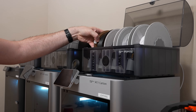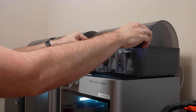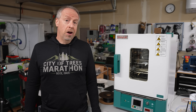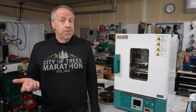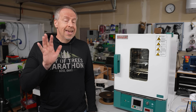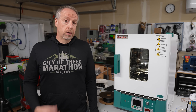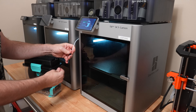When I loaded the filament into the AMS unit on one of my X1 Carbons, the printer didn't recognize it. I played with it for a while, reset the printer a couple times, and then gave up and set the material type manually. It turns out the spool doesn't have an RFID tag because it isn't intended to run in the AMS — and checking the website confirmed it's not supported. The filament does load and feed, but it's really rigid and I don't know how reliable it would be, so I reloaded it in a poly dryer box connected with a piece of PTFE tube and started the prints.